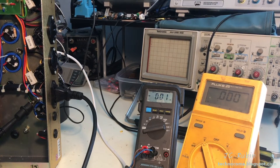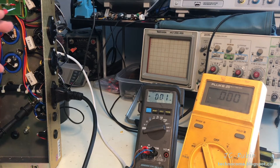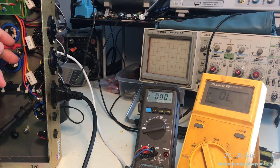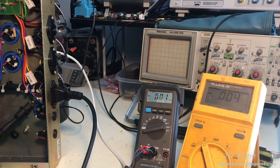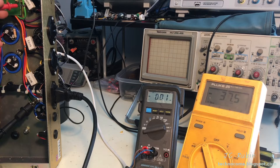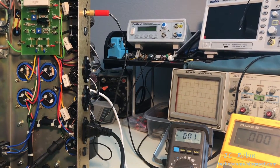Before I do anything with regard to taking these out of standby, I checked the filament voltage - AC is looking good on the power tubes. I just wanted to have a quick look and see what the bias is, make sure bias is functioning. I see negative 37.4 volts, and that's tied across all of those right there, so that looks good. I see negative 37.4 on the other side - just different colored wire.